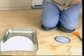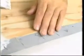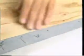So now that we've got the primer ready, we'll take our brush, take the primer, and prime it along the flashing. Now you'll notice the flashing here has been nipped. The reason for that, because if it wasn't for the nipping, there'd be oil canning and there would be ripples. And we can't have any ripples because we want that nice and tight with the tape. Now what the tape does, it bridges that gap, the seam between the metal and the plywood. Once you put the tape over the crack, now put another coat of primer over top, sealing it in.